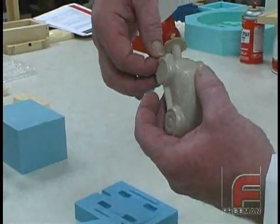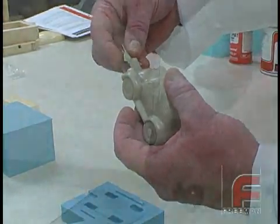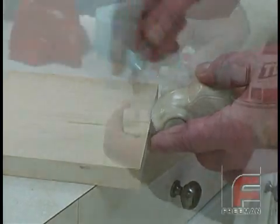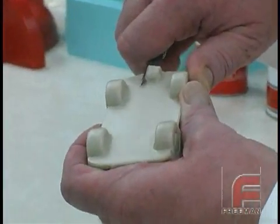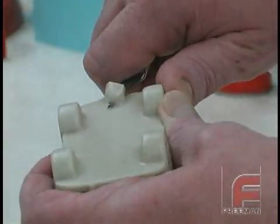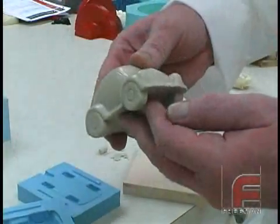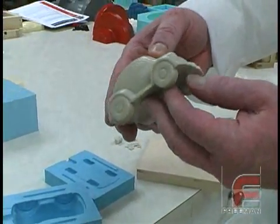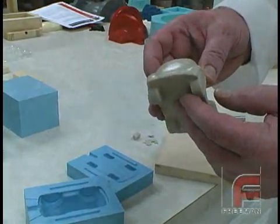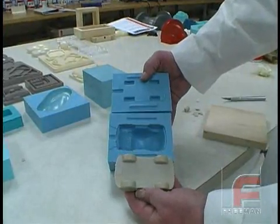Now is the best time to remove our gate, while the Repro is hard enough to handle and yet soft enough to cut with a knife. We also removed the part of the gate underneath our model. If we had let this fully cure, we would have had to machine or sand this off, which would take a lot more time. Finally, here is our finished model car, along with our two-part mold. Since we used a high-quality silicone rubber from Rhodia, this mold will produce numerous high-quality parts.